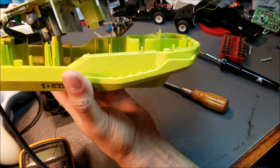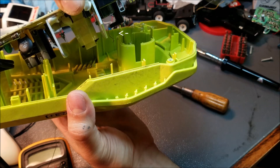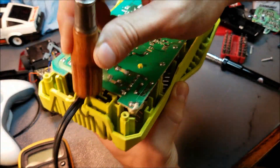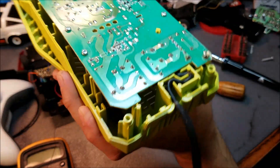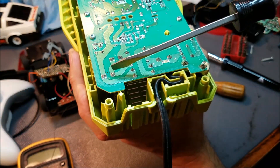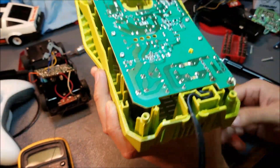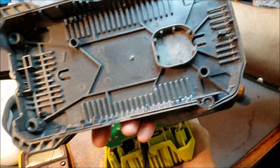I had trouble putting the board back in because there's this little finger right there that has to go perfectly vertically down into the top half of the case. By the time I finally realized I could discharge the capacitors by shorting them out with a screwdriver, it still hadn't occurred to me that the unit is functional now. Those capacitors will just discharge themselves because the electricity is going through that chip I replaced, into the transformer, to the charge circuitry, and being dissipated as heat. Unlike earlier when the unit was not working and the charge in the capacitors had nowhere to go.